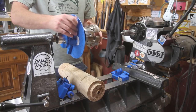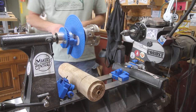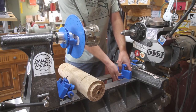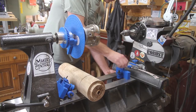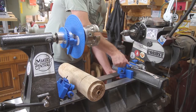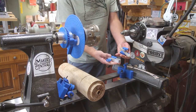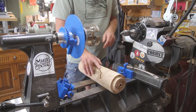You put your workpiece in the chuck — the lathe isn't on while you're doing any of this process. There are a couple of little pieces where the chain rides on, they're little guide wheels, and the other end has a little sprocket on it. I'll show you real quick. Just lock that down like that, and same with the Flute Master part — these little stops right there are your guides for where you're going to be cutting.